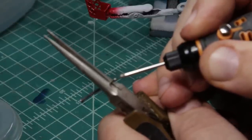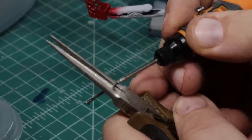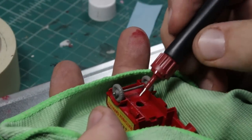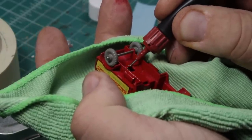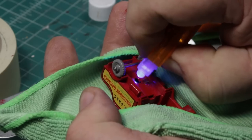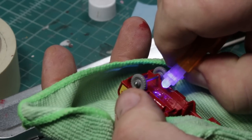Here's something I've never shown you before — I started doing a little more hammering of axles. I found it beneficial to put a dimple in the end of the axle because it weakens the edges and gives some steel to fold over. That's what I do and it works better. I told you I over-drilled that hole and I didn't have any little washers. This is one of those areas where Bondix does a wonderful job — I'm not really asking it to hold any weight, just asking it to bond. It worked great.